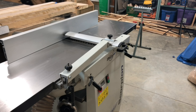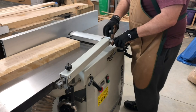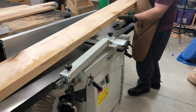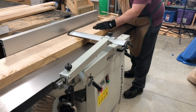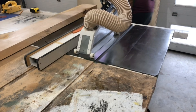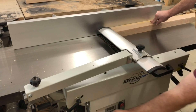I start off by doing the border, just cutting them to length, and after that I take them over to the jointer and run both the face and the edge. I've got a few different boards since it's a king-sized bed, so the horizontal pieces will be longer than the vertical pieces. I'm getting a reference on both the edge and the face, then cut them to the overall width, just a little shy of three inches.